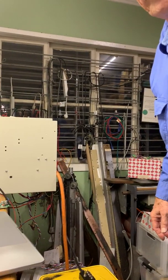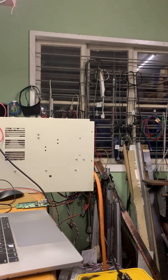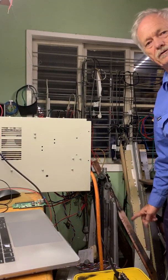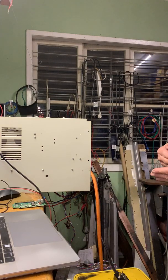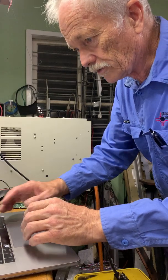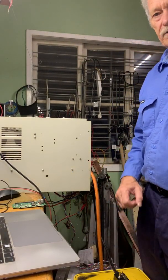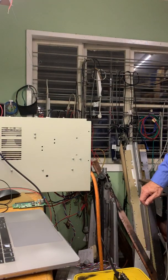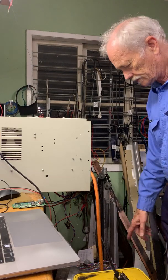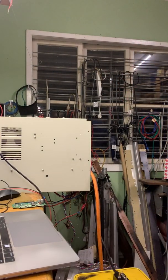So initially, before I get started, I need to be able to set up the motor. This motor has got a resolver on it, which tells where the rotor is. This is necessary for a permanent magnet motor to actually function properly. So if I ask for a slow rotating current vector in three phases, and I can adjust the voltage and current to a suitable amount and have a frequency that's low enough, I can probably get that rotor to turn a bit like a stepper motor.